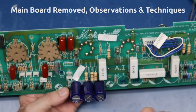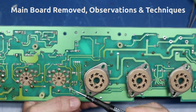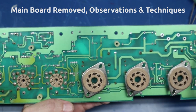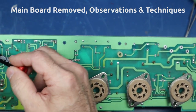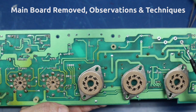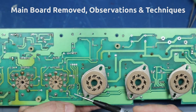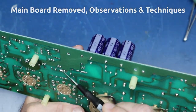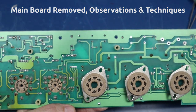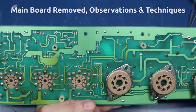As I got into it and looked at the underside of the board, I could see that where the capacitors were replaced, they had big large blobs of solder on this side of the board. Unfortunately you can't see that now because I've removed all of the caps and cleaned all of the resin - the board was a mess, there was resin everywhere, flux on the bottom. I've cleaned it all and I've reflowed about a third of this. My point is: too much solder is not good either. You want a nice fillet where the solder bead comes up good all around the circumference, creating good mechanical and electrical connection. You don't want a great big blob or bead.